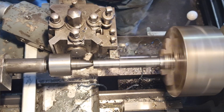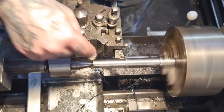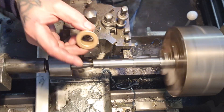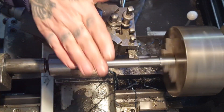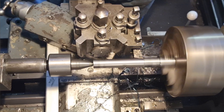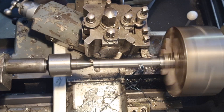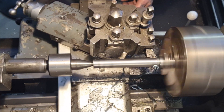I might machine the other one differently - put the fat end where the centre is and machine it left to right. The critical size is the bearing over the bushing, and again that's not exact - it's not a wheel bearing, it's a forward control. It moves about 10 degrees every time it's used, it's just to stop it seizing up and to do the job proper like. Nothing here is spacecraft tolerance critical, it just needs to be a nice fit. We should machine this down and hopefully it won't be too far off the finished size.